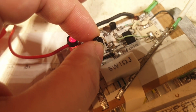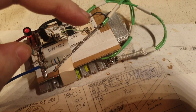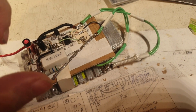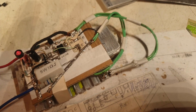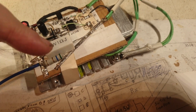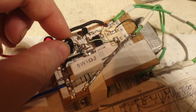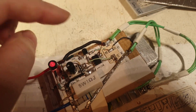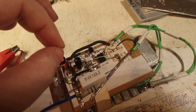I'm actually moving it quite a lot, a little bit, so I'm having a very good resolution between 2 numbers. So the idea is that resistor was bad for the circuit that I'm dealing with here. It was good as the beginning circuit, but not adapted to what I'm having here. So I started to adapt my resistors, these 2, and by adapting them I solved this very important problem with the potentiometer jumping too fast from one value to the other. So now I'm having a very smooth transition.